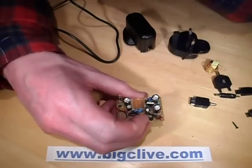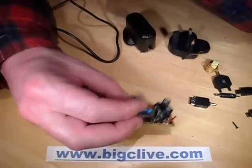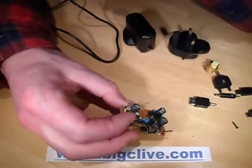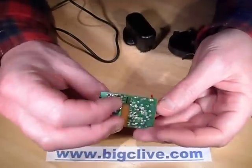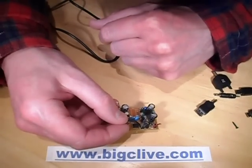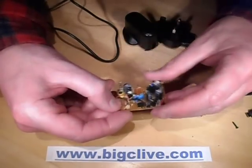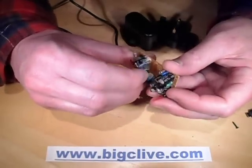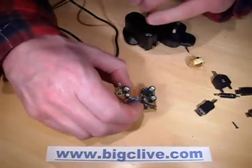The main thing is that I managed to short circuit the output when testing — trying to get the probes in — and it survived a couple of short circuits, putting out just over 5.5 volts. It's got a choke in the input for filtering and a choke in the output for filtering. Outwardly it seems to be quite a decent quality power supply, which is surprising — particularly for a pound, which is pretty much dollar store level. So yeah, that wasn't too bad.